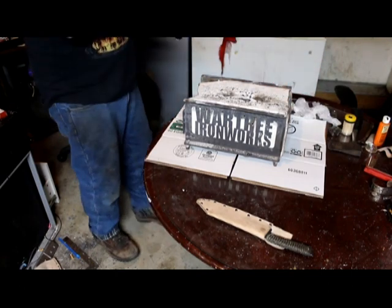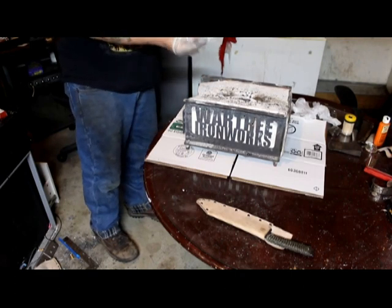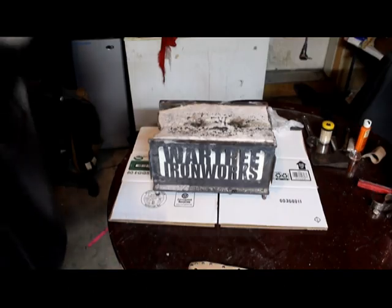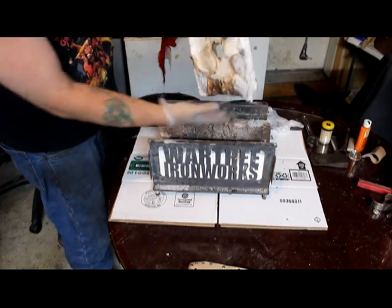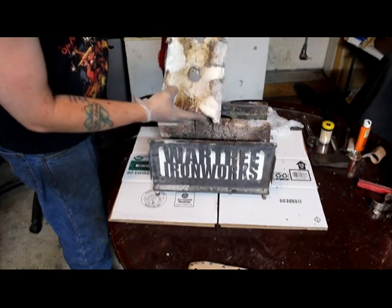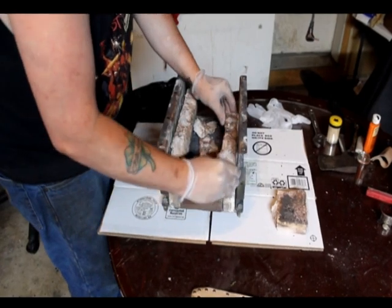We're going to reline it. Don't forget to put your gloves on. That's very, very necessary to wear when you're relining a forge. You always want to have gloves on hand. So we're going to pull out the old K-wool and throw it away. I suggest you check with your local garbage service and ask them the proper mode of disposal for that.